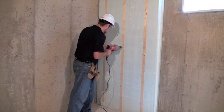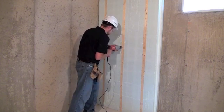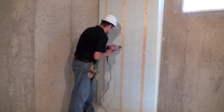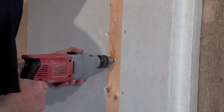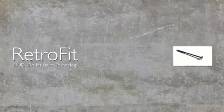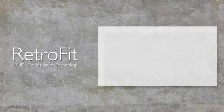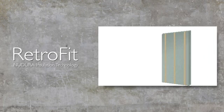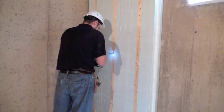It's recommended that you use a hammer drill to drill the pilot holes for the fasteners. For walls less than 8 feet or 2.44 meters in height, you can cut the insulation technology to fit around the floor joists. Refer to the installation guide and technical data sheet at Nudura.com for further recommendations. To ensure drywall is not interfered with during placement, use flathead screws that will sit flush to the wood furring strips after placement. To make fastening the panels easier, place your first fastener into the middle of the panel on the fastening strip to hold it in place. Fasteners are to be placed vertically every 2 feet on center or 600 millimeters on center up the vertical length of the fastening strip.